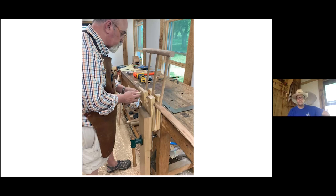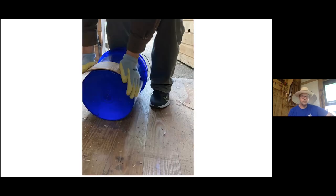Here's another center finder. This person has one half of a chair drilled with the tenons and stretchers in place, and he's marking with the center finder where he's going to drill the next set of holes. After the chair is put together, I use a bucket to limber up the back slats to get them to go into the chair a little easier. I don't use a bending form ahead of time — I use the chair itself as the bending jig.